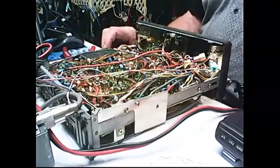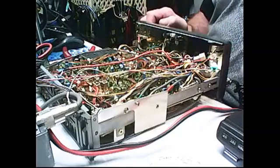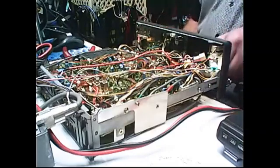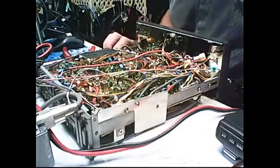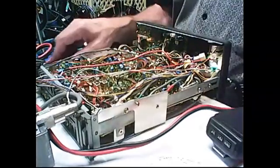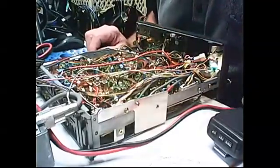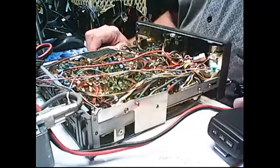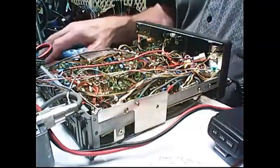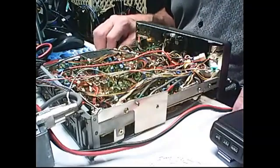Yep, same thing — it's good. And on FM, cut the power down. Yep. So we've done it. We have the frequencies that we need. For the rest of the alignment, that'll be another video. Hope you enjoyed it. That's how you can make a bad capacitor — or bad crystal — work. Is it the real way to do this? No. But it's what I had to do to make this thing work. At least now when I key out, I know I'm on the right frequency.